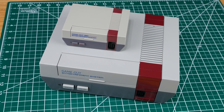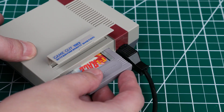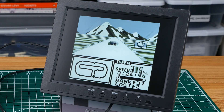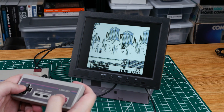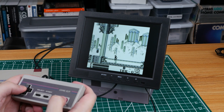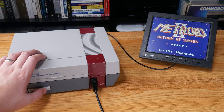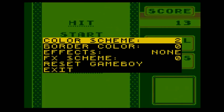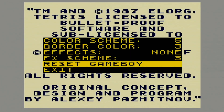I didn't have time to paint it but I did print a couple of stickers to make it resemble its bigger brother at least somewhat. And I just love that this has a working cartridge port. F1 Race is a good one for testing because it requires very accurate video timing to display correctly — it's also pretty fun but the difficulty ramps up very quickly. This is Castlevania 2 and it's one of my favorites. Unfortunately like many Game Boy titles it uses a password system instead of saving games, but at least there's no chance of battery leakage. To show off some of the software improvements: on the larger console I replaced the reset button with a color button to cycle through palettes, but Joe programmed an on-screen display that you access by holding Select and pressing Start. There you can change the colors, the border color, choose various effects, and even reset the Game Boy. I love how this works.